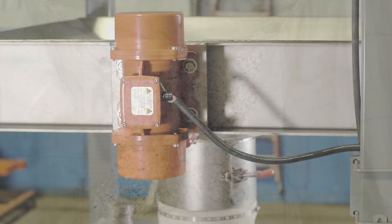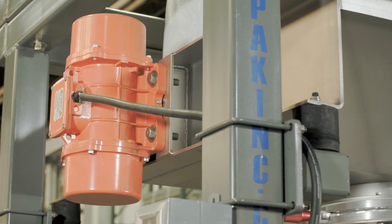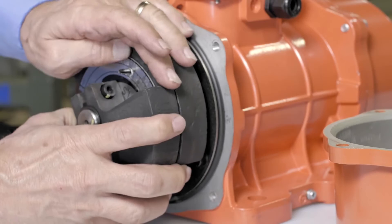Refluidizing the material to ensure complete discharge from the bag, the 100% duty cycle vibrator has 1,500 pounds of max force and is the machine's only moving part. It is completely adjustable and will likely never be replaced.